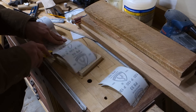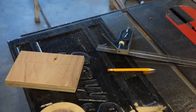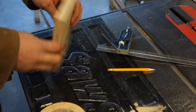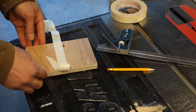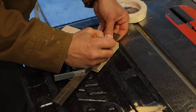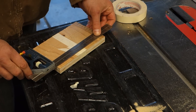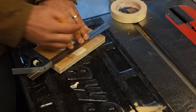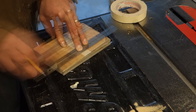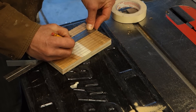But here's the thing about making a sanding mop and deciding if you want to do it — this is the spoiler alert. Whatever you use to cut your sandpaper, cut the strips — be it a bandsaw blade, jigsaw blade, scroll saw blade — whatever you use is going to get destroyed. Not just dulled, but destroyed. I didn't fully appreciate that when I went into building these, but just understand that from the beginning.